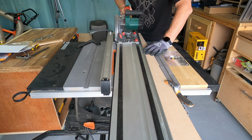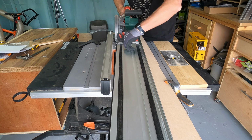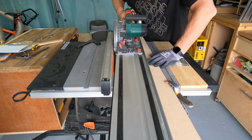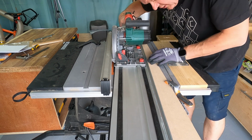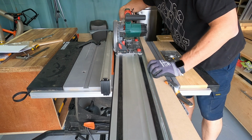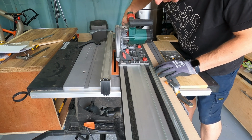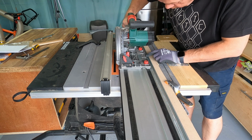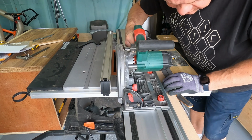Whoop, whoop. And actually, looking as I'm running the saw down and pressing it hard against that line, the line that's from the piece of metal I cut, the edge actually isn't too bad. I've got a solid equal distance all the way along now. Oh, I was going to say it stopped there, but that's because the saw's against that. I've got about a mil. There's just one place there. I've got about 2 mils in one bit there, but the rest of the gap is really, really consistent.